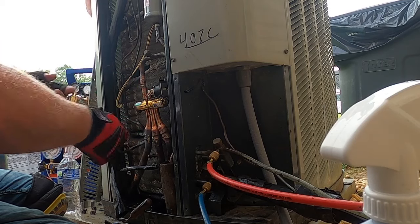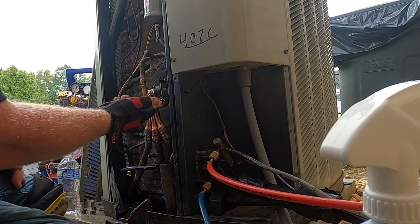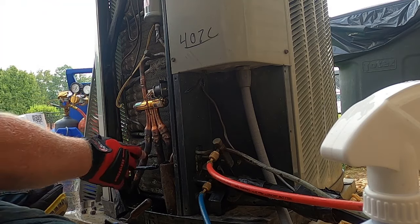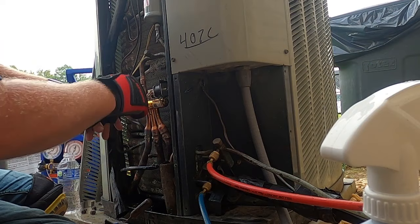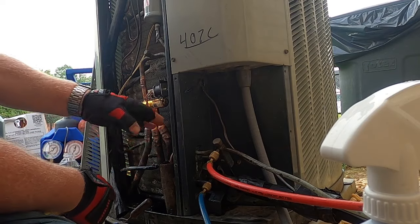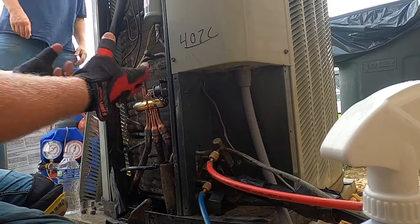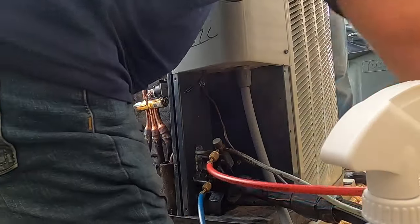Just because if you sit here and try to do all those fittings at one time, you're going to build up so much heat in this valve. You start seeing your stickers bubble and melt, then you're going to have a problem with it. So what I'll do is I'll get this one, cool it down, do this one, overlap them, pour water on it, and it runs down the side, it doesn't get in the system, one at a time. That way I never let it sit here and just build heat and build heat and build heat. So all right,